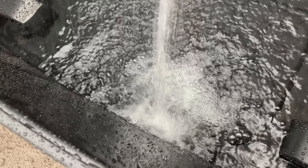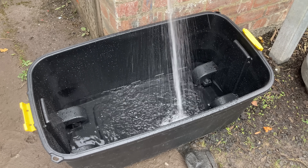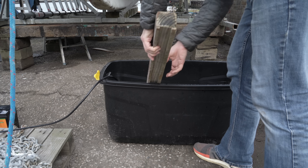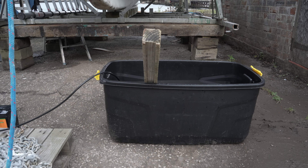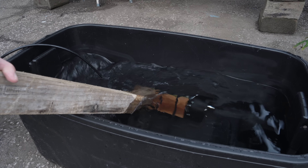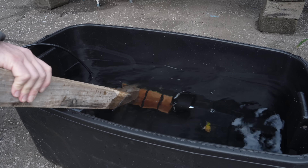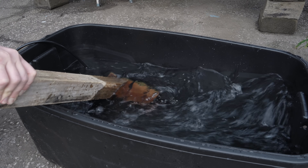Now for some water. I thought one of my many storage bins would fit the bill. Really this test isn't so much to confirm the motor spins underwater — I'm sure it will. Rather, it's to give the motor some cooling as I run it at the full rated current of 50 amps and then see what's up with those thin wires. I mounted the pod onto a makeshift bracket and then dunked it. I've no idea how powerful 22 kilograms of thrust actually is in practice, so this was something of an experiment — the test tank might be gruesomely underspecced. With only the slightest power applied, the pod moved itself along the tank. I went and held the bracket as best I could and this built up to only about 50% of the thrust — it was hard to keep control of whilst keeping another hand on the little controller, which I needed to keep dry. I'm going to have to make a proper mount down in the marina to do a test like this again.